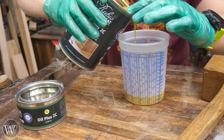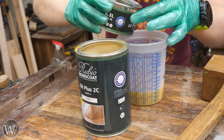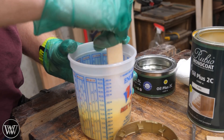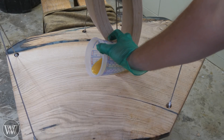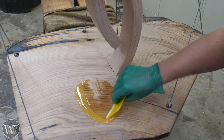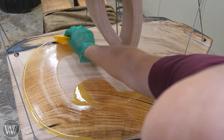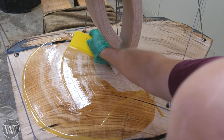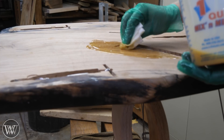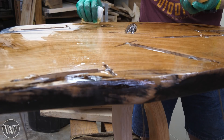For the actual finish we are using my all-time favorite furniture finish — this stuff is phenomenal. The only downside is it is crazy expensive, but this is a hard wax called Rubio Monocoat. I get it with the hardener as well — you can do it without the hardener but it just takes longer to cure. You pour it onto the surface, smear it around, and want to leave a nice thick film on all surfaces. I'll use a squeegee to move it around and then come back with a rag to apply a little bit heavier in places that need it, then let it sit for about 15 minutes.